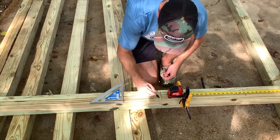And then at the top there, you can see I don't have those jack studs, or cripple studs rather, in there because I'm field verifying to make sure that the plan dimension that I have included is actually going to be perfect here. In my case it was, but you might have an 1/8-inch discrepancy depending on the compounded error. Here I am cutting them to size, and then I'll go ahead and place them within the window's rough opening frame. There I am positioning it, and then I'll take my nail gun and hit those a couple times, making sure that it's secure. And once I repeat this process for the other side, I will have a perfectly framed window in one of the shed sidewalls.